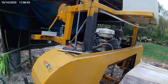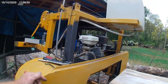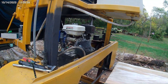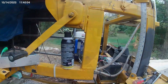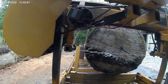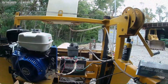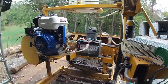I made this cover on the front — it's got two snaps on the bottom and two on the top, and I put a piano hinge in here so if you undo it you can pull the piano hinge out both sides and take this cover completely off and get in there and work on it without too much trouble. If you stand here and you look at the size of this log and where it's going and that blade on there, it saws a lot of wood for a homemade piece of whatever you want to call it. But I thought you'd get a kick out of seeing it.